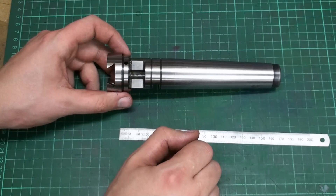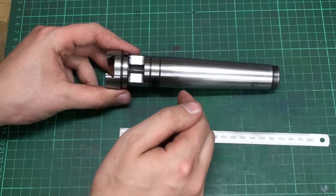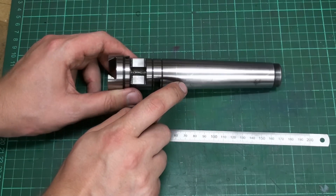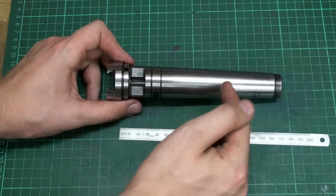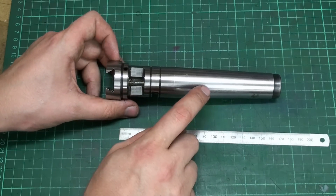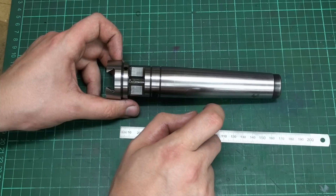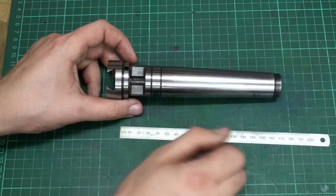There was a lot of discussion in the thread about machining the shank down — it might be hardened, or it might be way too hard to machine, or it might explode, or whatever. I stepped up and said I will machine it down for him. We're going to cut it off with the cutoff disc on the angle grinder, then go to the lathe and machine or grind with the tool post grinder the shank down to 20 millimeters and put a nice finish on it so he can clamp it in his collet chuck.